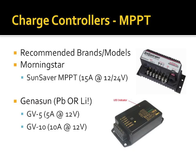The switching side of it, this thing actually has an on-off switch. It would allow you to connect a load to the battery through this thing. There's an optional meter for it. It would allow you to track all of your power usage, etc., going through it. Problem is, our radios need 22 amps for a full power 100 watt radio. And this thing doesn't have a fuse, it just has a smart switch that when it detects overcurrent, it basically shuts off for 10 minutes and waits for the load to reduce and then turns itself back on.